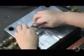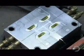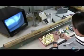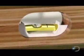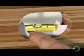The vials that pass the test then go into a molding system. Melted plastic is injected into the crevices to make a cradle for each vial. Next, a technician glues the cradled vials in the openings in the wooden framework. This is precision work. Each vial has to sit perfectly level, so technicians rely on a magnified image to check their progress.